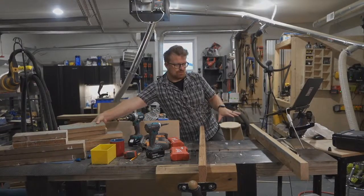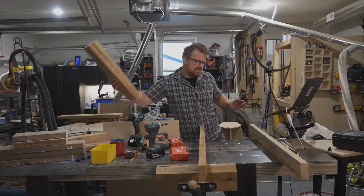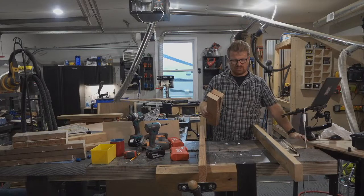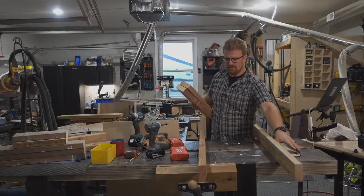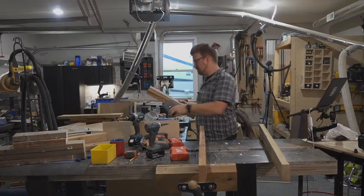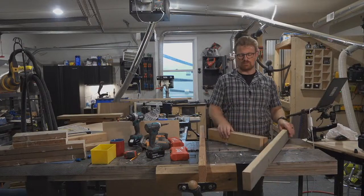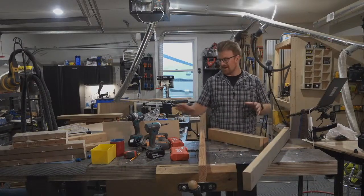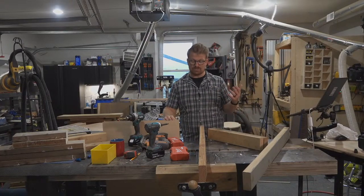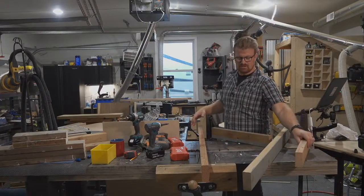So I've got two 48-inch segments here. And to connect those, generally people only build them with two, but I'm gonna build these with 3 segments, with one in the middle to reinforce that piece. That way I get a little bit stiffer board. It'll make it a little bit more difficult to finish. The other reason I'm reinforcing it is because regulation, you're supposed to have a 1/2-inch top for rigidity. And all I had was 1/4-inch plywood, and plywood's also really expensive. So I wasn't about to run out and buy some super expensive plywood to build a yard game.